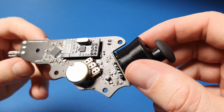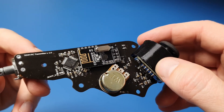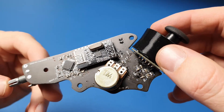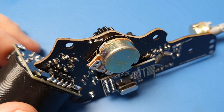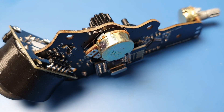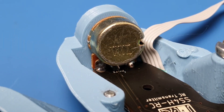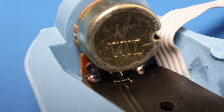Of course I wouldn't be myself if I hadn't made a few stupid mistakes. And since I try to make my videos a bit educational, let's talk about them. The main power switch is connected the other way around — I used the normally open pin instead of the normally closed one. Luckily, clippers and a wire saved the day. The rear potentiometer doesn't have enough clearance to be soldered and I had to use a Dremel to adjust it.